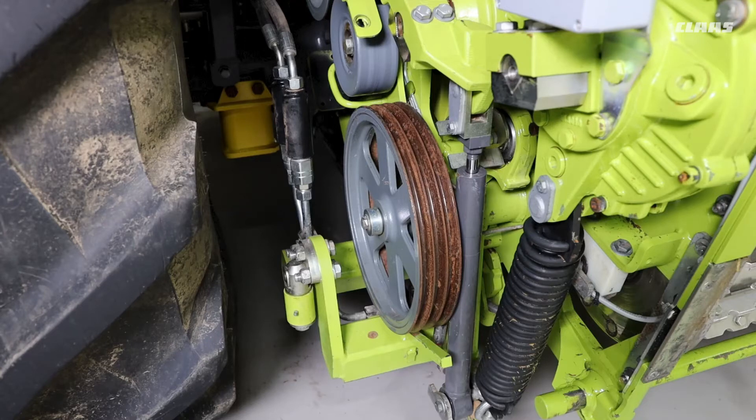If you need to carry out any maintenance procedures, such as removing or accessing the feed rollers, we can then remove our hydraulic couplings. To remove those hydraulic couplings, we first need to decompress the hydraulic pre-compression to make sure that we don't have excess pressure within the system.